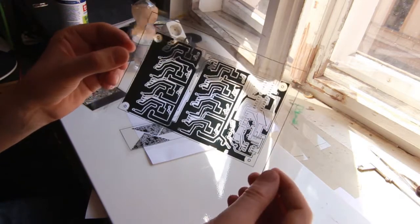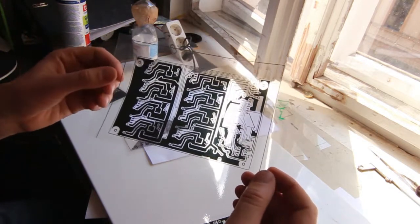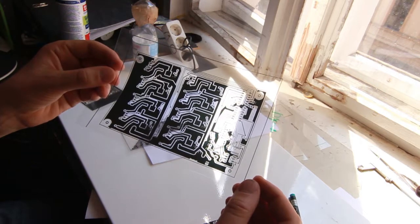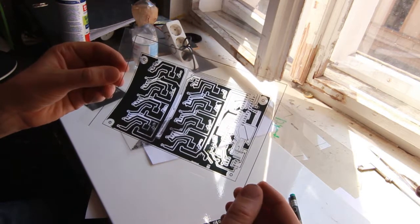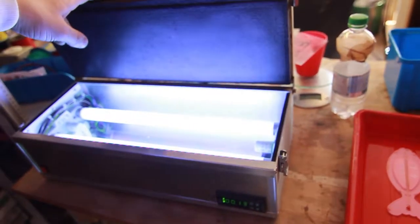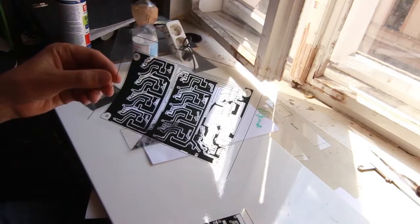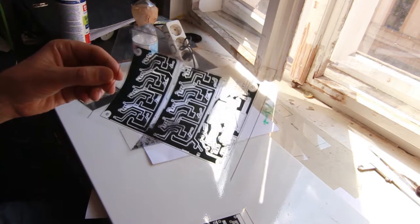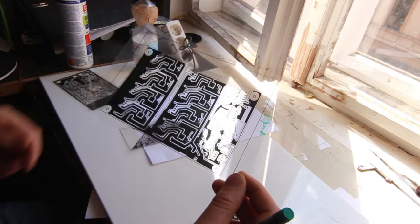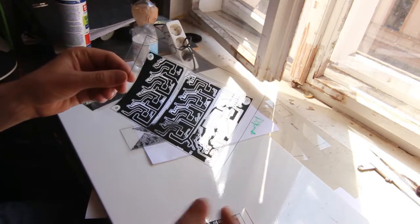The idea is to make a foil for PCB creation. The mask is the most important part in the PCB creation process, because when you have a foil or mask which has no good black, the UV light will go through and will ruin the photoresist, so the actual etching process will also be failing. To create a good mask, and then of course to have a good UV system, is something hobby people and semi-professionals should really put stress on.